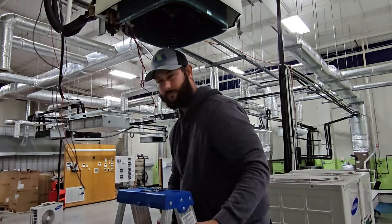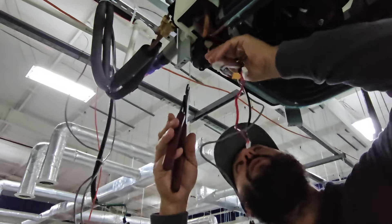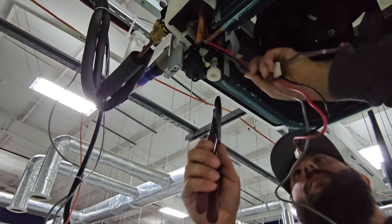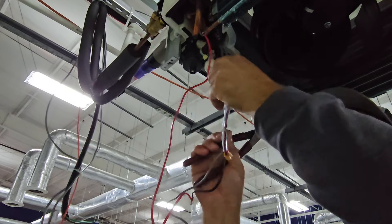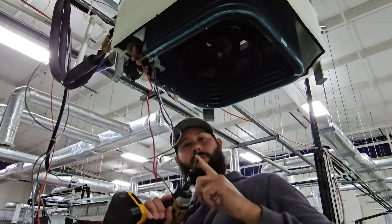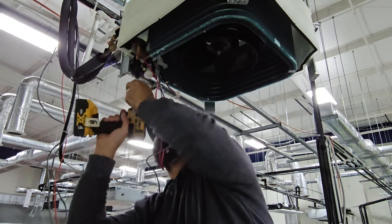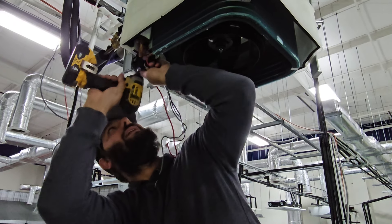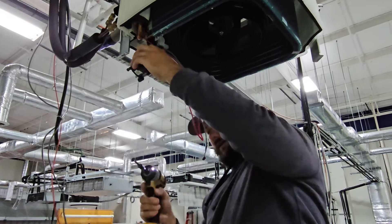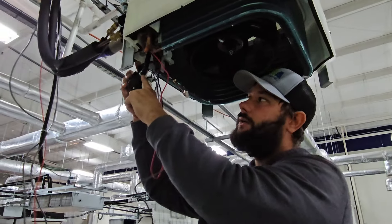This is where you would want to have some type of cutting tool. Normally, we would cut this zip tie right here — well, cut the zip tie, not the wires. Why would we cut this zip tie? Because it holds the wire that goes to the pump and to the float switch. Now take a Phillips screwdriver and take the screws out — there's one screw here and another screw here. We can't get the pump out until we take off the outlet tube for that pump.